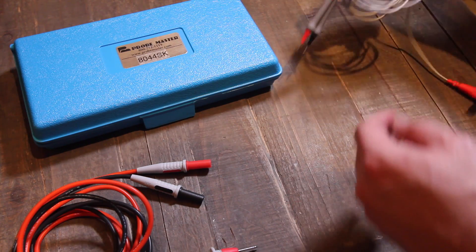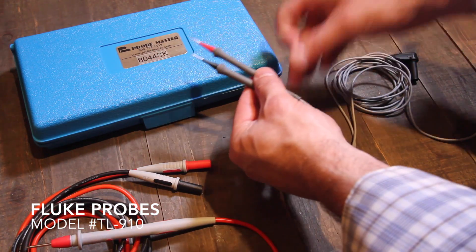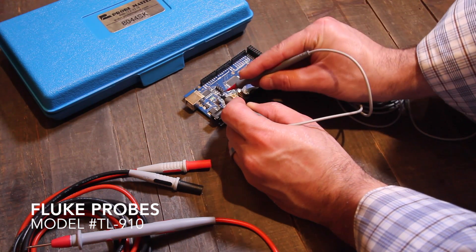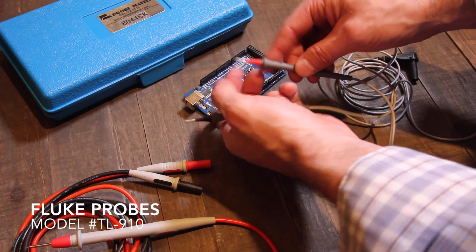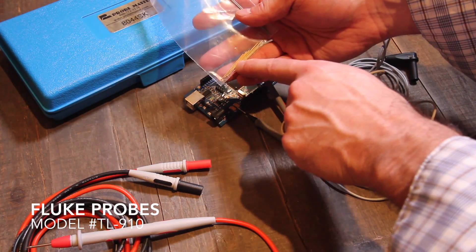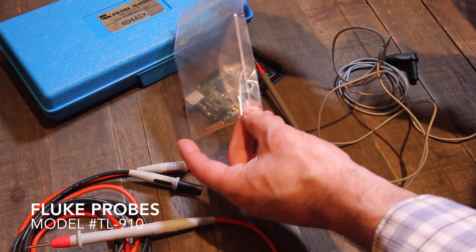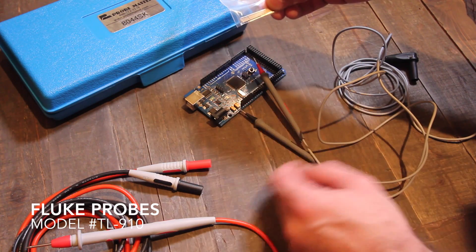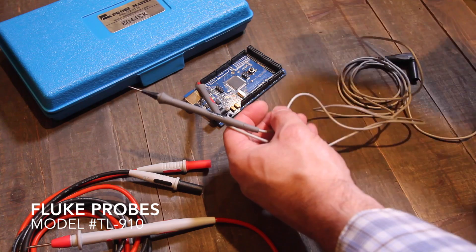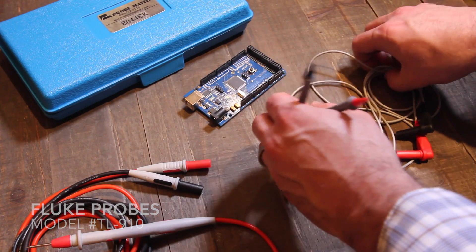However, I do like these by Fluke — they're the TL910s. You can see just the size difference between the two. These are great for boards or really hard to reach places. If you want to get down and probe a surface mount component, these things are just precise — the tips are really, really sharp. They also come with nice little attachments; you can change the tips. They have pogo plugs that are gold plated, and even really long tips for getting into hard to reach areas. The cabling is small and thin, again siliconized, with nice right angle banana plugs that work for your digital multimeter.